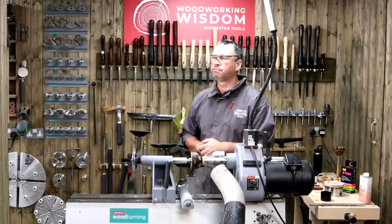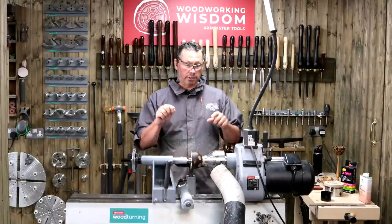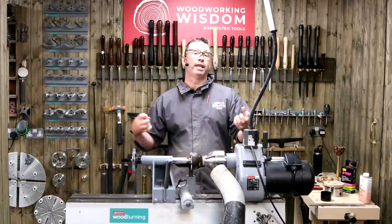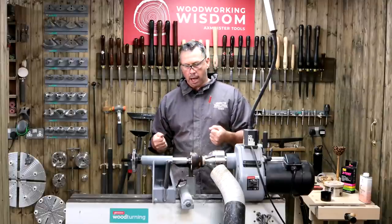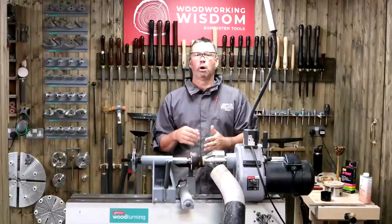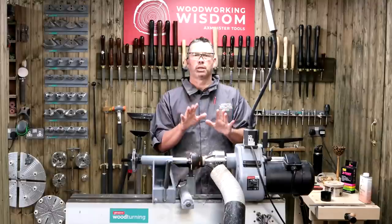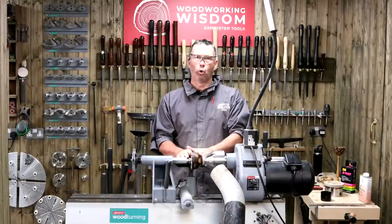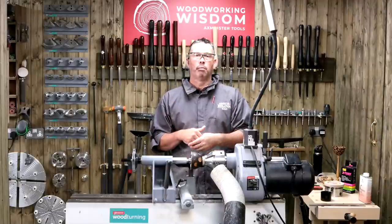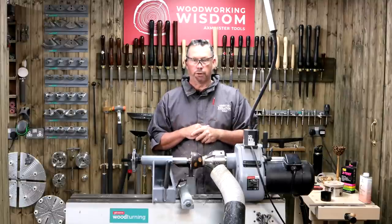Yes. And Lazarus is asking, did you put it in a vacuum chamber to draw the air bubbles out? Okay, so we'll dispel a couple of myths straight away. Vacuum chambers, like you said, take out the air. They expel it completely. If I was worried about bubbles in this particular project, though, I would go to a pressure pot, where we shrink the bubbles into non-existence. That's what I would do here normally. And generally, a pressure pot is a much bigger vessel than a vacuum chamber, just because of physics. You're able to create a much bigger chamber for pressure.